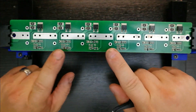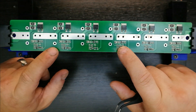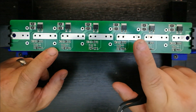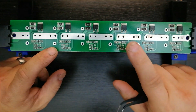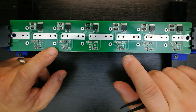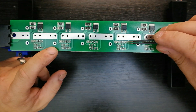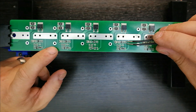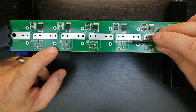On the top side, we first need to remove these two current-limiting resistors because that's right where we cut — you might as well save them for another day. Plus we need to change all these circuits from 2.7 volts. They actually activate at 2.65V for the 2.7-volt version, and we're going to change them to 2.95V for the 3-volt supercapacitors. The only thing we have to do is pull off this 12-kilohm resistor and replace it with a 33-kilohm resistor, and that will shift the activation threshold to 2.95 volts.